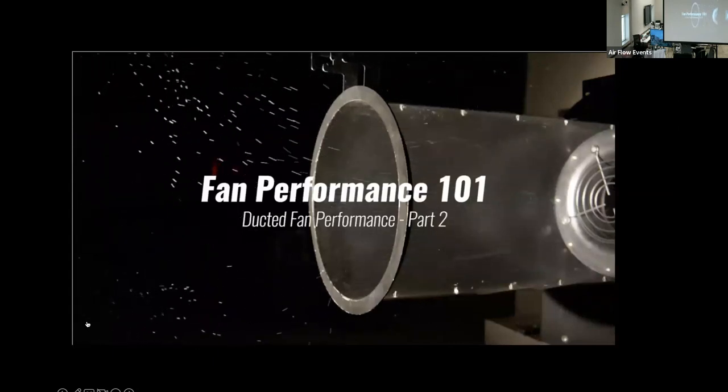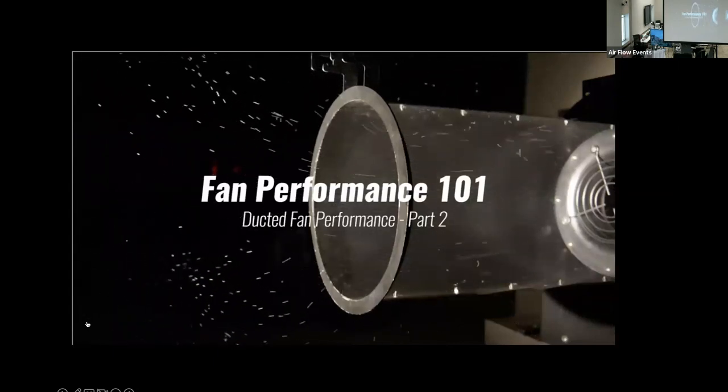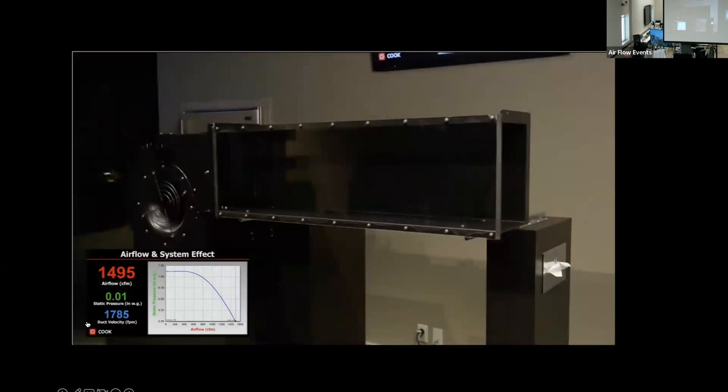Welcome back to part two of ducted fan performance. In this video, we will explore the inlet side of the fan and how different duct configurations affect fan performance. We will also demonstrate system effect and its associated consequences. As a reminder, the base performance of the fan is 1500 CFM with no static pressure.